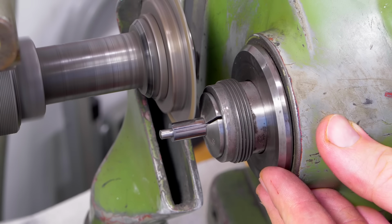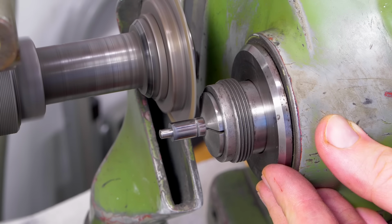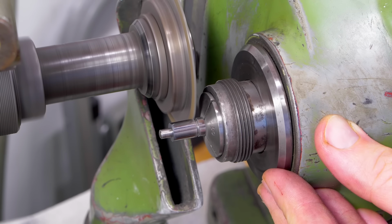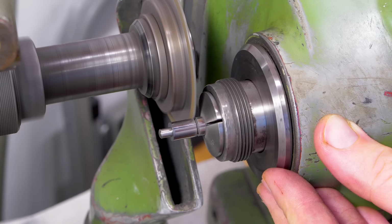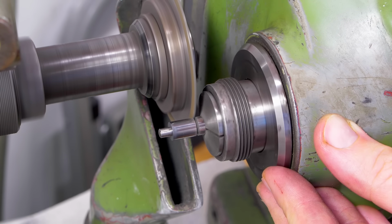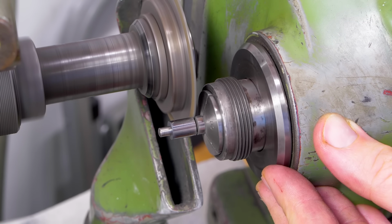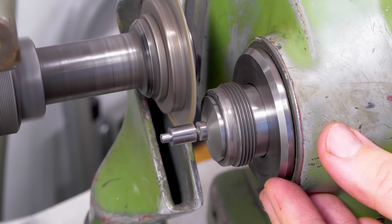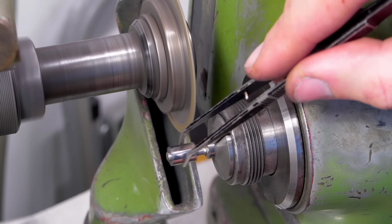And I'm putting a pin inside the bushing, so when I break through the carbide, the cutoff piece doesn't snap off on a remaining thin section of carbide, and also it doesn't drop down into the dust extraction. Yes, it's a steel pin, and you shouldn't cut steel with a diamond cutoff wheel, but I'm only scratching into the steel, so it shouldn't be a big problem. Also, this cutoff wheel does not want to behave at all. It tends to chatter a little bit. Not sure why.